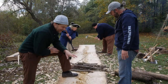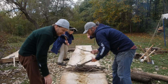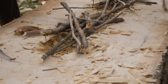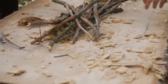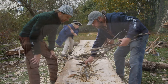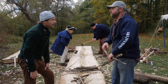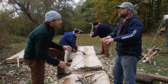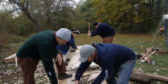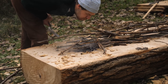We've made a trench to get started — that'll give us a place for air to get under. We're going to take smaller sticks, maybe split some wood as well, and stack them all up along here nice and loose, like a nice airy campfire. What we want is heat with air on this wood to burn it, and let all that flow through. Let it burn clear to white ash — once the fire is going, don't feed it anymore, let it burn until it's gone, then add wood again. With each burn we can expect anywhere from five-eighths to three-quarters of an inch of wood removal. We don't want to build up ash because ash insulates and stops oxygen from hitting the wood — we want oxygen and heat on this wood to consume and burn the fuel.